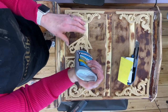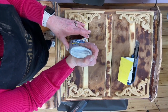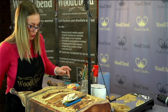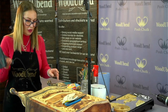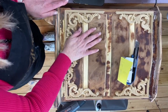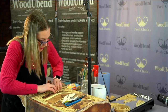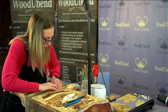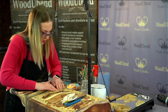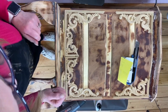Put my glue on, spread it out and make sure that the glue covers all the back side surface of the Wood U Bend moulding. I'm going to warm it again with my heat gun and really press it down into the surface. And as you can see I'm not spoiling or damaging the design of the Wood U Bend moulding — it just springs back up to its original form.